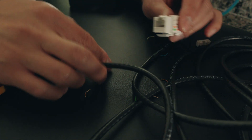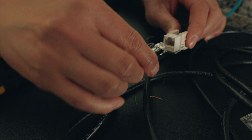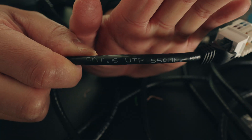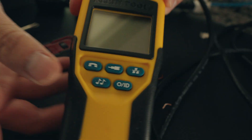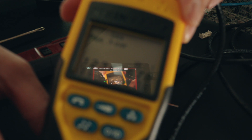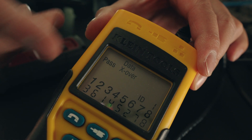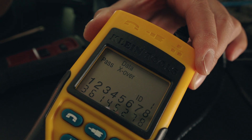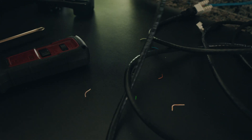Here's the ultimate test. I put the keystone jack upstairs and already connected it up there. Now I just plug in this Cat6 cable on the other end and turn it on. I'm going to press this button — awesome, I got a pass! The X-over means it's crossed over, which is okay — that's something from way back. Switches these days don't care if it's crossover; it used to be just for uplink but now it resolves itself. I should be good to go — let me plug in real equipment and see how it works.